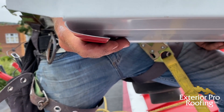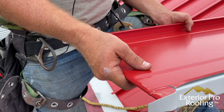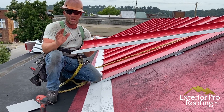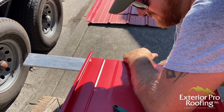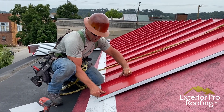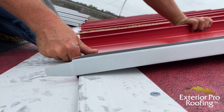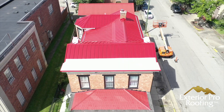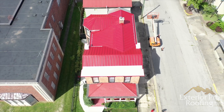The way it works: we've got a hem on the panel — the same type of hem that would go over the edge of a drip edge or on an offset cleat in a valley. We turn the metal panel down an inch and a half, then take the hem piece, lay it onto our new piece of weldable trim, snap it on, and pull the panel right into place. That's how we set the panels onto the trim using it as our cleat.